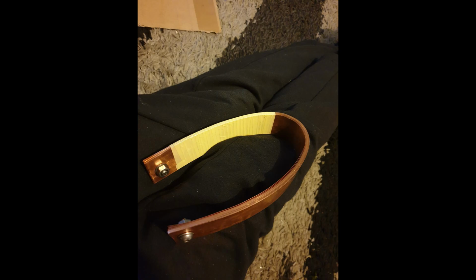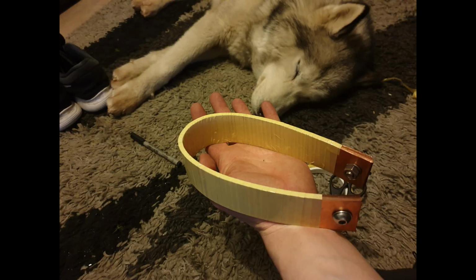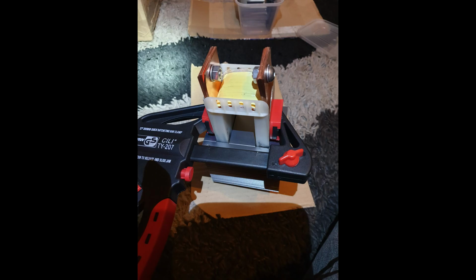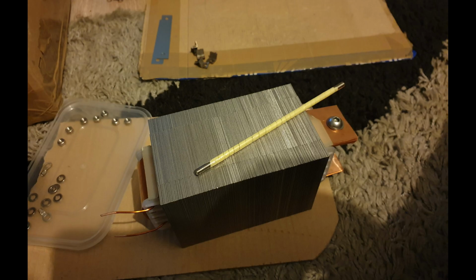So I taped the actual secondary winding right up, right round. This secondary winding wasn't pushed through like in a horseshoe action. It was the E&I laminates that were stacked up, right? You'll see now in the photos coming up. It was built like this because it needed to be clamped. You wouldn't be able to pull that out if you tried. So tight. I used all the winding window area, as was the plan.